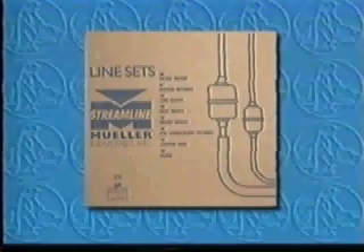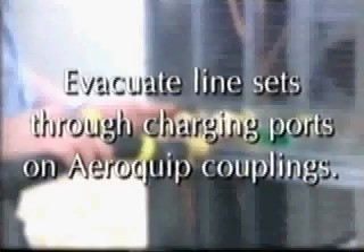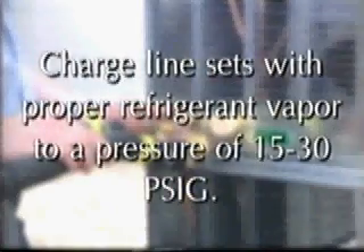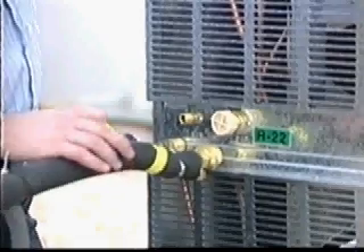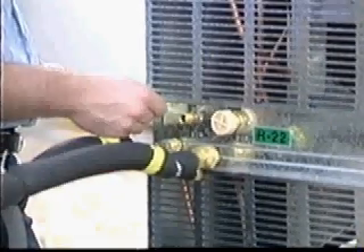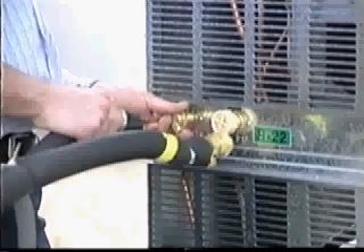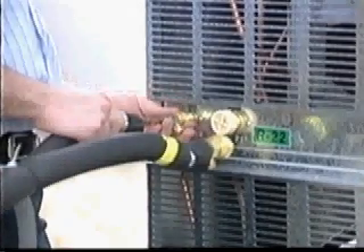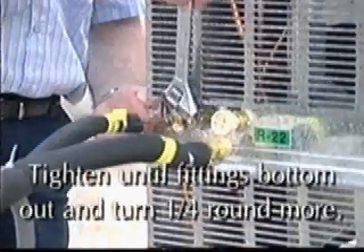Each copper tubing should be sized properly and insulated separately. Pre-charged tubing kits are available from Hoshizaki America in 20-, 35-, and 55-foot lengths. Line sets fabricated on the job should be evacuated through the charging ports on the Aeroquip couplings and charged with refrigerant vapor to a pressure of 15 to 30 psig. Pre-charged tubing kits do not need to be evacuated. To connect line sets to the condenser and ice-making units, remove the plastic caps that protect the couplings and place a small amount of clean, dry refrigerant oil on the O-rings and male threads of each connection. Connect the refrigerant lines equipped with the proper-size Aeroquip fittings to the condenser unit and ice maker, then tighten the fittings until they bottom out and turn them one quarter round more.